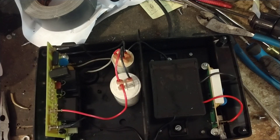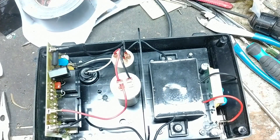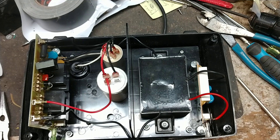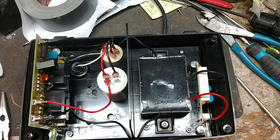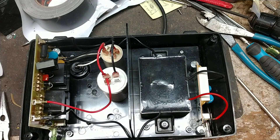Inside the unit you get your main input board, which has a bunch of capacitors to gradually build the charge up. On this particular model they call it the multiplier circuit. All those big black rectangular things on the board are capacitors — it gradually builds a charge up through all of them, then gets over to these two bigger capacitors. There's also a timing mechanism on the board along with some other components, and it does all of this within about a second or so.